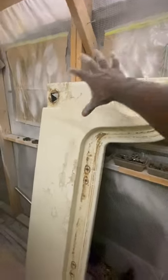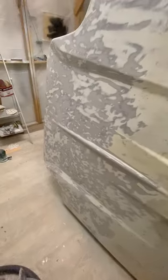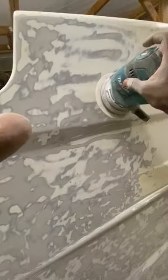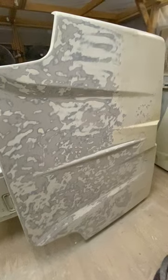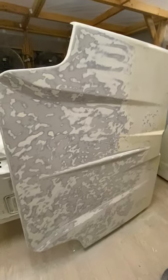You need to sand — this is a challenging part, sanding all that and getting it flat. Once I'm done with the 80, I'll go with 320 to take all those major scratch marks off, or even 120 — I reckon I'll use 120 too, so it'll grab the epoxy quite well.